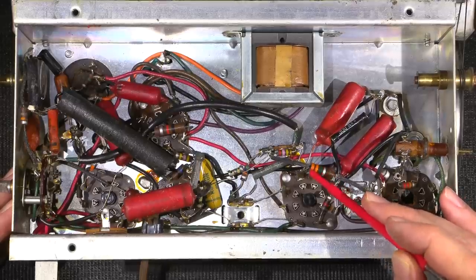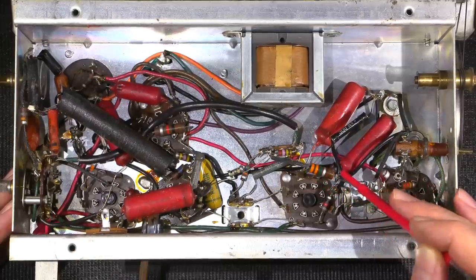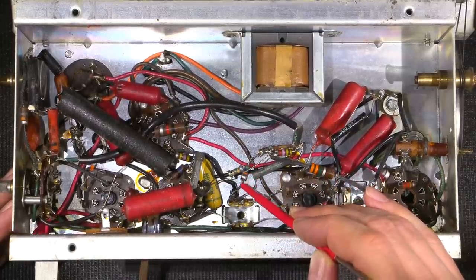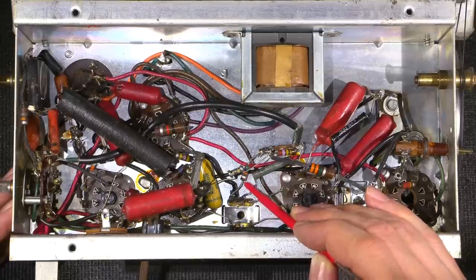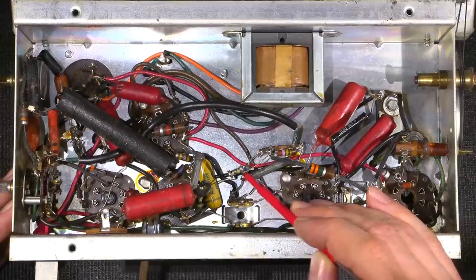So Allen Bradley resistors are the resistors like this. These are carbon composition resistors, and they have the squared off ends on them. So this one here is a roundy. This isn't an Allen Bradley style resistor. This is the one with a porous body, and moisture ingression can get inside these things and cause them to drift in value. So I always test these things.